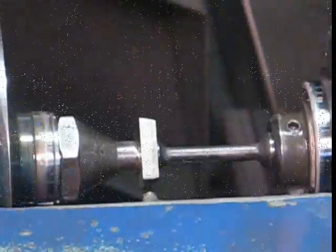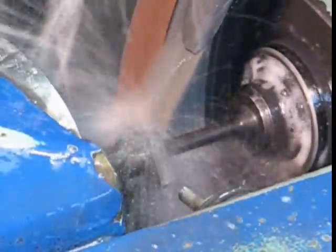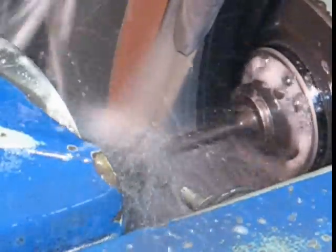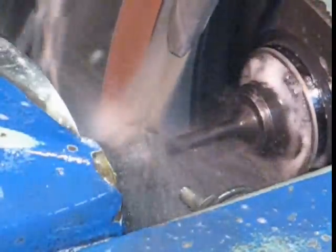Capacity of IC sizes vary with the shapes, but common IC size ranges are from three sixteenths to one inch, with edge and facet relief angles from negative to twenty-four degree positive.